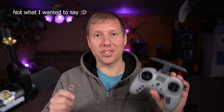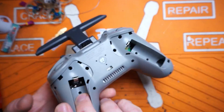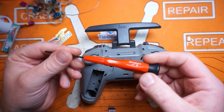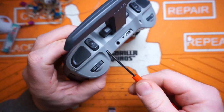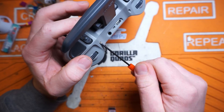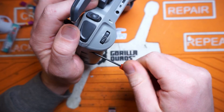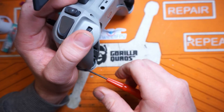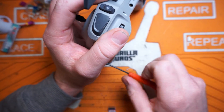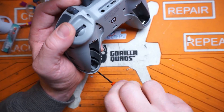Let's head over to the bench and unscrew this thing. Not happy, not at all. First things first: get the radio, get the back off, pull the batteries out. Grab yourself a double-ought Phillips. We have to pull screws out of this thing — ten screws total. I'm just going to fast forward this because it's just me turning a screwdriver.